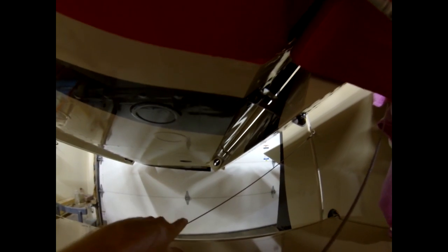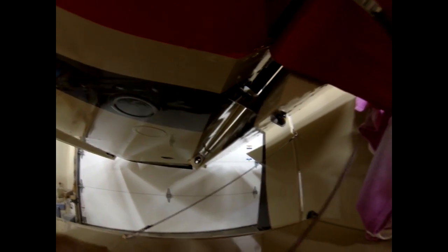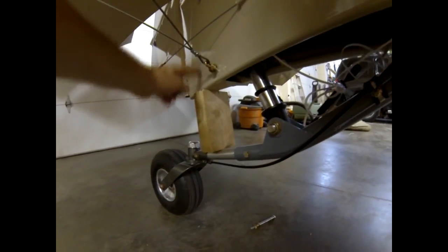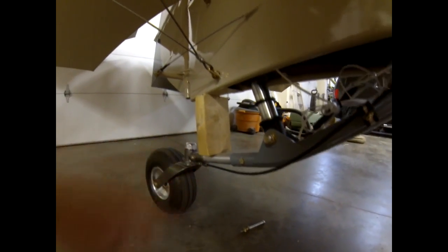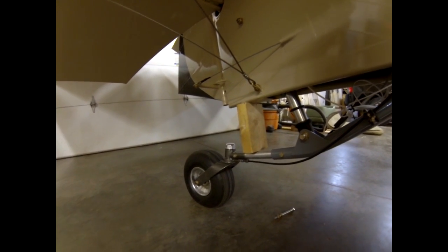For trailering, I built a bracket — I don't know if you can buy these from the factory but I bought a piece of chromoly and built it. I've got to powder coat it yet, but it ties the wing ends down so the wing is solid. I've got a paper towel roll in there now but I'm going to put a nice triangular-shaped foam piece in there, clamped or taped for shipping. I'm also going to build a block that bolts down tight to the hole so it can't move, and we'll tie it down to the truck that way.